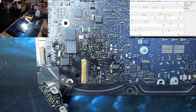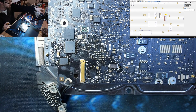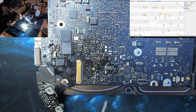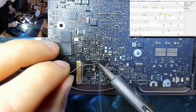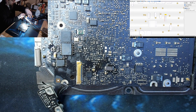The fuse comes right off — easy peasy. No need to handle it carefully, it's a dead fuse. Now doing a bit of tidying up: putting some flux on the area and re-tinning the pads so they're ready for a new fuse. There we go.